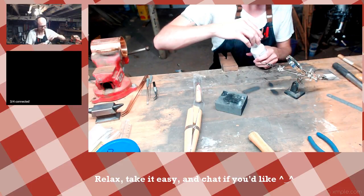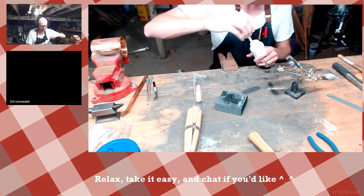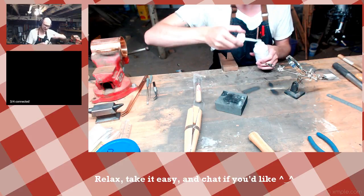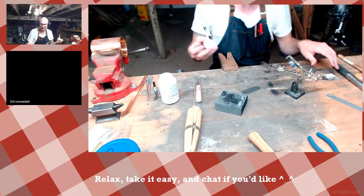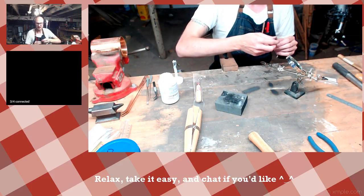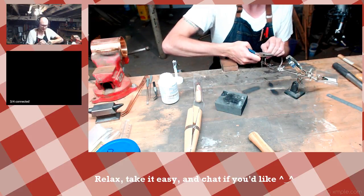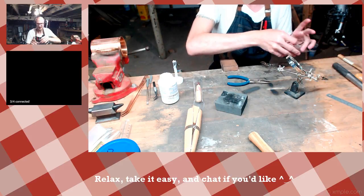So I'm not using silver or lead solder. You can use those in working with copper. I did a bunch of reading again, and I continue to learn. The reason I did not want to use those though is because when you do that, the seam ends up showing pretty strongly, and I don't want the seam to show up. I want it to be hidden. So I did a bunch of reading, and eventually I found that they do make copper solder. It took me a while to find some for sale online, but I did.